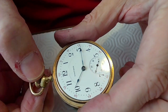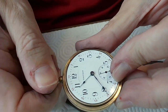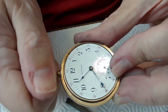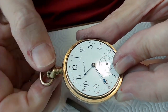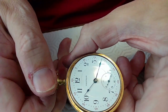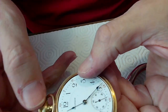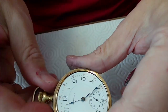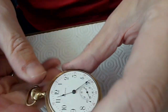Oh, so that's working now! That's done. Now the question is when I push this in will I be able to wind the watch? Seems like it's winding. I think the mainspring is slipping or something. Yeah, I've got a mainspring slipping problem but this is working perfectly right now — turn that, sets the time, push it in. I'm not sure if the owner cares that the mainspring is slipping a bit, but I may have to fix that.